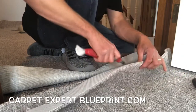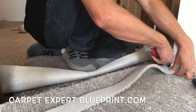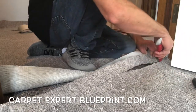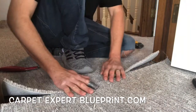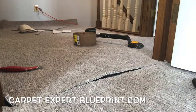Now we're gonna go ahead and finish cutting all the way through this. Do not pull on the piece you're cutting through when you're dealing with pattern carpets or loop carpets, because if any of those strings are still attached you are gonna create a disaster. That's why we're going a little bit slower on this one. Boom, got that out of the way — let's make sure the line aligns just right, and it looks like we're in good shape. So we're gonna go ahead and find some seam tape.